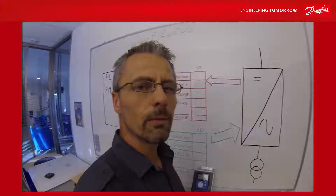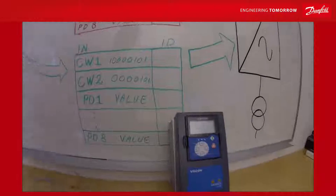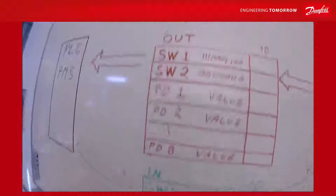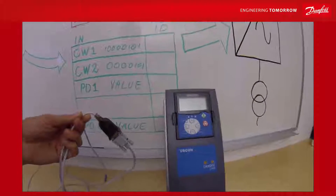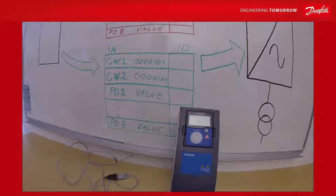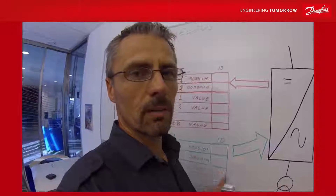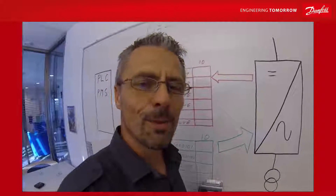Before we leave the grid converter and move on to other topics, an advice is to bring a small frame 4 frequency converter to your office and train the field bus and parameter setups at small scale. This frame 4 doesn't need any license number to work with the applications, so you only need the hardware. This way you will get familiar with both the field bus, the parameters, and everything else, and you will save a lot of time during workshop and full-scale commissioning. Thank you for watching.